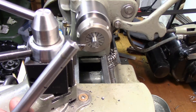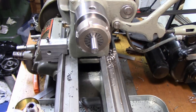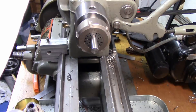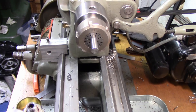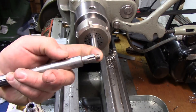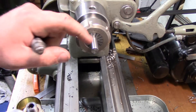There we go. I'll get that little nub off of there and use my large calipers to measure and see how close I came. I did screw up — and here's where that built-in fudge factor comes in. This measurement is wrong: I took the measurement of the dial but forgot I also have to put a nut on the other side. So I went back and the actual dimension is one inch instead of eight hundred and eighty three thousandths — I'm off by a hundred and seventeen thousandths. That means it just won't go as deep into the gear blank, but we still have over an inch and three eighths of bite on it.